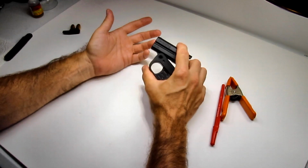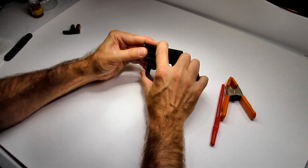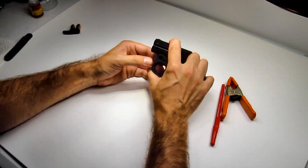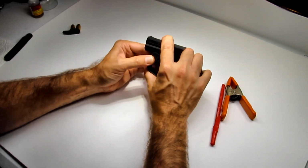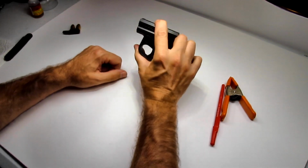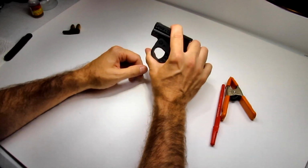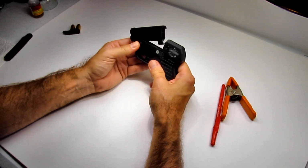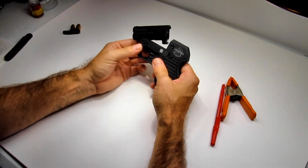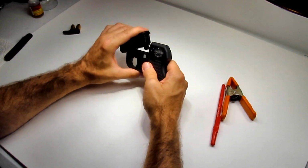If you've got a 9mm barrel set, you could swap it out for this 45. I only have one barrel set, which I will now replace. You just kind of eyeball it and get it pretty close to center. And if you get it right, and I actually found that using my hand in exactly this fashion lines up that barrel perfectly, and you see how easy the pin went back in. Now that pin's actually locked because there's a little C-spring that goes around that pin that locks into the frame, so it shouldn't want to work itself out under firing stress.